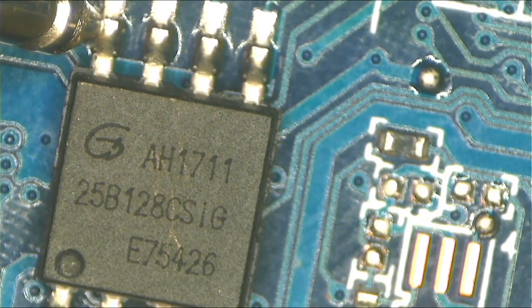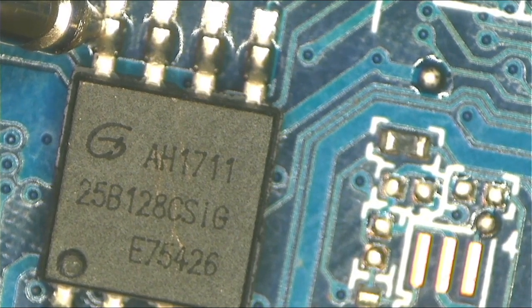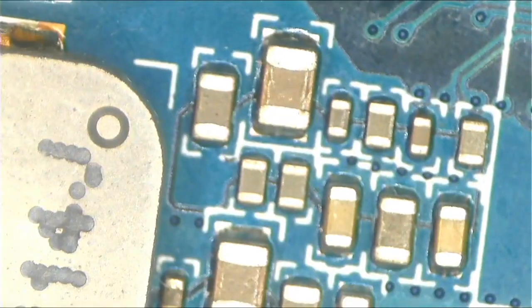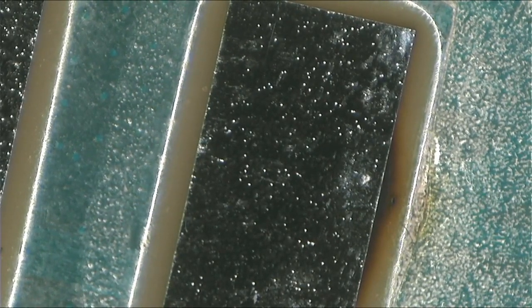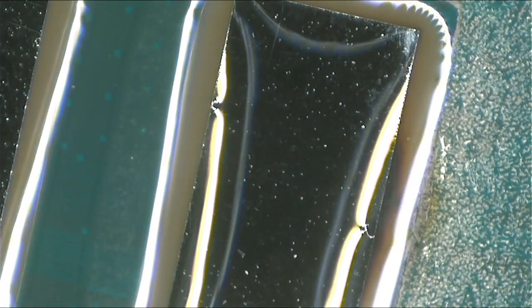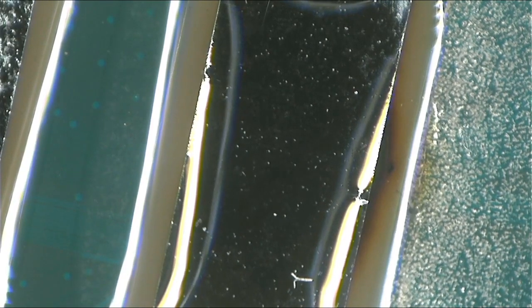I'm going to put it to two amps so it becomes more obvious. It's hot — the PCH is hot. Let's go to our PCH — there we go. The CPU side is fine, but the heat is coming from here. What you do is put some alcohol on it and observe: even if I move the board, the alcohol stays in place, not moving.